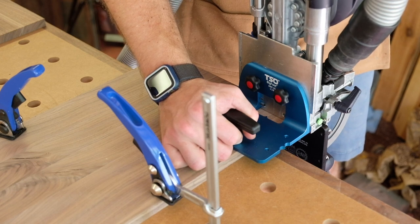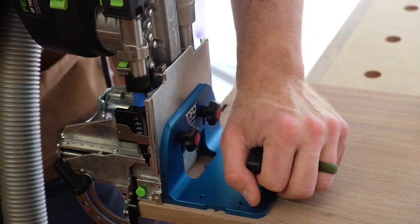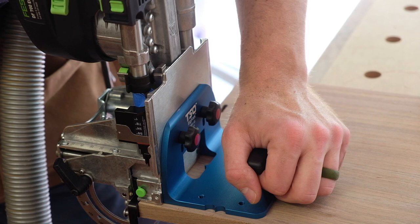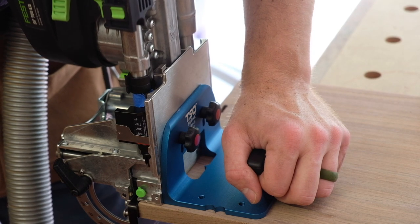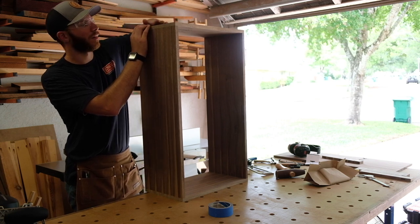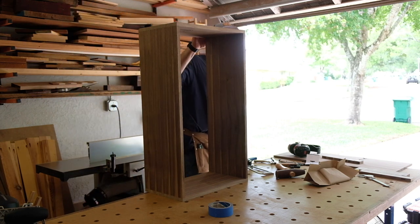I'm also going to point to some spacers here, which I'll link in the description below. And these allow you to plunge more shallow than the Domino XL necessarily lets you. It's made for thicker material, but if I have these little spacers here, I can plunge much shallower without blowing through the other side of the material.